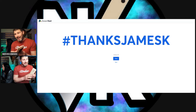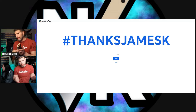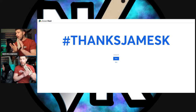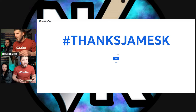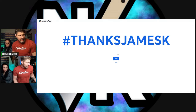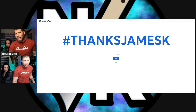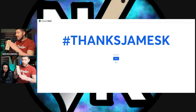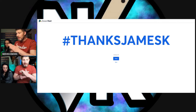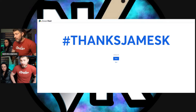Man, I'm kind of liking the 6,000 grit stone. Out of all these, the 6,000 is actually pretty good. Obviously you can't use it to reprofile or to sharpen, but you can use it to refine and hone. It's nice and hard, because personally, guys, I love hard stones. I just kind of despise softer stones. These stones are okay. They're good for simple steels, but too soft for anything heat treated hard, like 60 HRC or higher. This stone's nice and hard. It's not going to cut carbides, especially steels with high carbide volumes, but it'll still work really well for simple steels, chef knives and carbon steels.